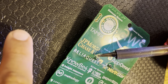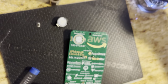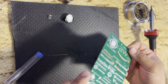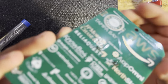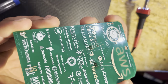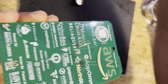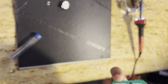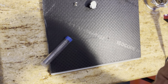We'll get a close-up in just a second. Make sure your iron's clean and put it back in a safe place where it won't cause burns. Now if you look real closely, you'll see that the solder is not touching from one side to the other and it has a nice little cone shape. We'll go back at the end and trim the leads. They look good to me.